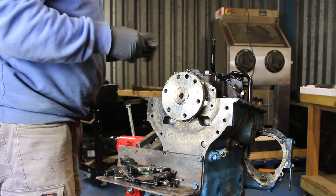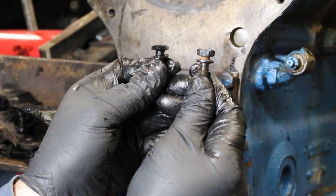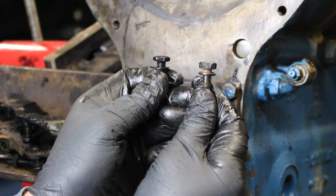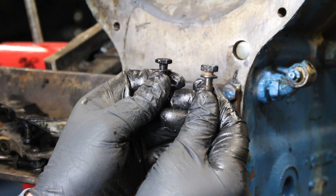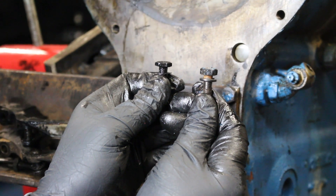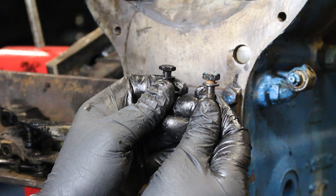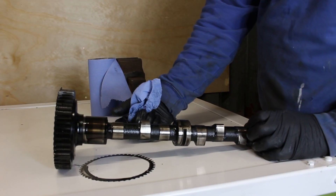There's the top one, so that's the rope seal off. There's just a little oil groove in there. What I was saying about these bolts — you can see the difference: the one on the left is the thin one from the carrier for the rear crank seal, and the one on the right came off the sump. If you look at the size of the heads, the one on the right for the sump is twice as thick as the one from the carrier. Don't lose the ones on the left because they're thinner — otherwise you'll be grinding a bolt head down to make it fit, like I've done in the past.